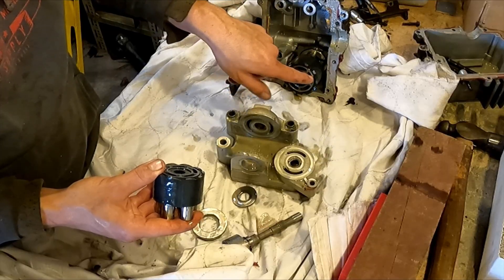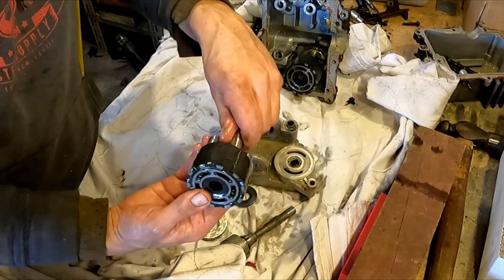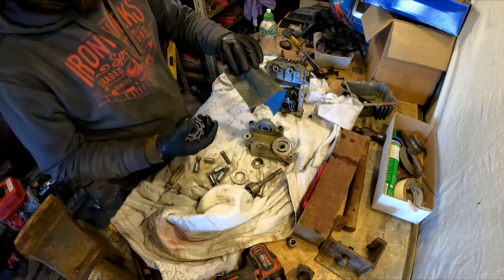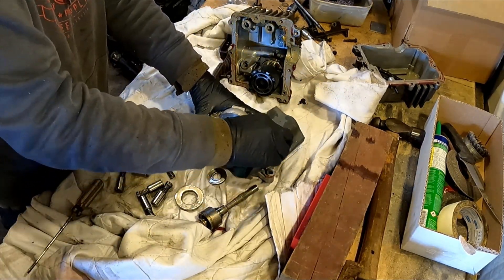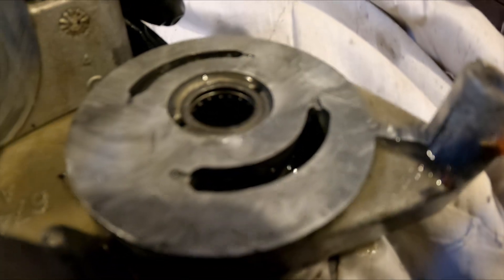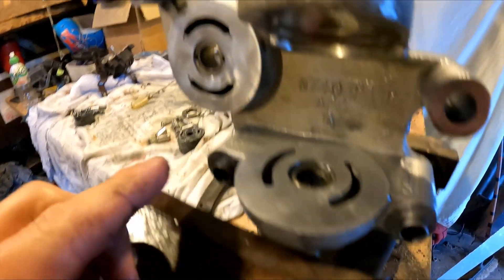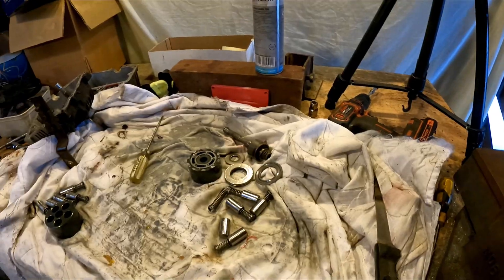This is how it works - this spins and pumps oil out here to this side. It's on a swash plate system so it pushes the pistons depending on what side it's on. The pistons are still nice and tight in here. I think the problem is this here is slightly worn. All we can do is wet and dry sandpaper that. This is how the guy did it - just got some 800 grit wet and dry sandpaper, put some water on it, get this thing on there and sand it for ages. I've been at it for a little while and it's coming up pretty good, but I can see a very faint line there - that's probably the oil bypassing. So I have to keep sanding until that's gone. Both surfaces have been done now, bit much better. Also do these surfaces the same way but with the sandpaper the other way up. Put it back together and see if it works.